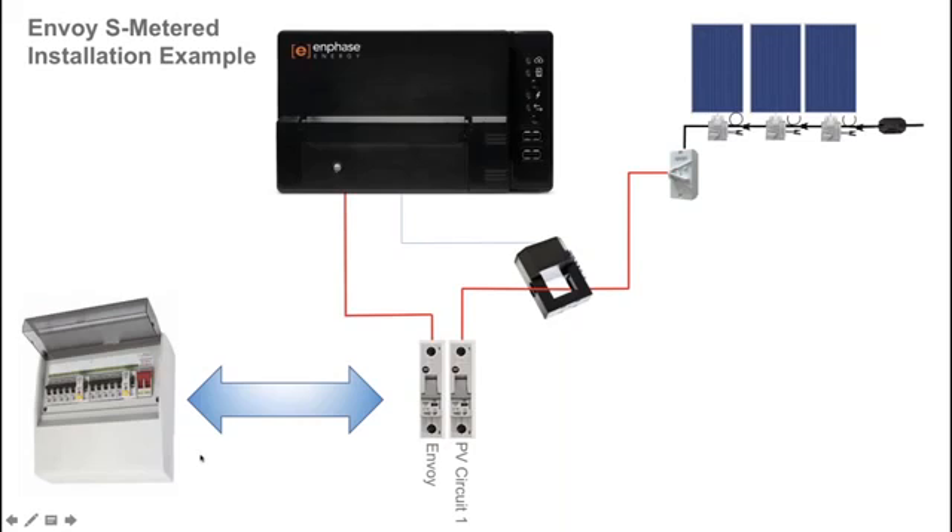The circuit breakers wired on site can be installed in a main switchboard, as the indicator arrows here show, or often for simplicity and added room for mounting you can install these in their own subboard connection, which enables you to simply fit off your solar and battery circuits.